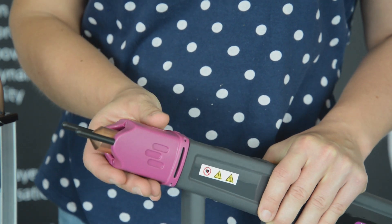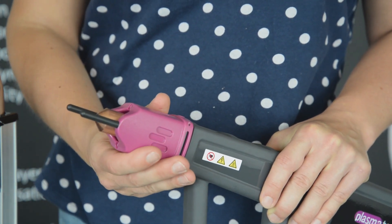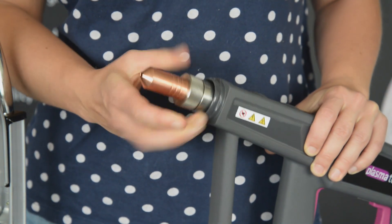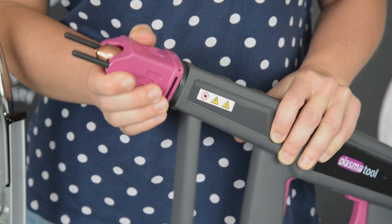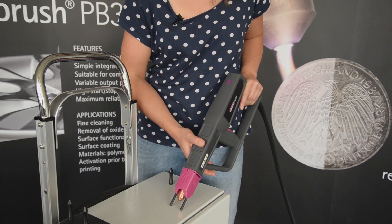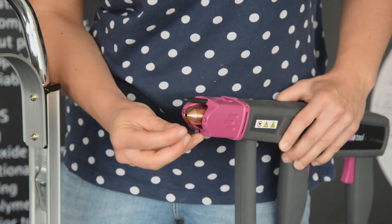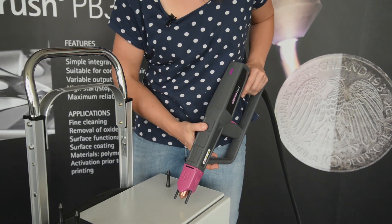The spacer here can be used in different positions. To take off the spacer, turn it at a 45 degree angle and pull up front. After taking off the spacer, you can change the nozzle. Then put the spacer back on. The spacer is equipped with black uprights which make sure that you keep the same working distance. You can also change the working distance by changing the uprights. Now you have a shorter working distance.